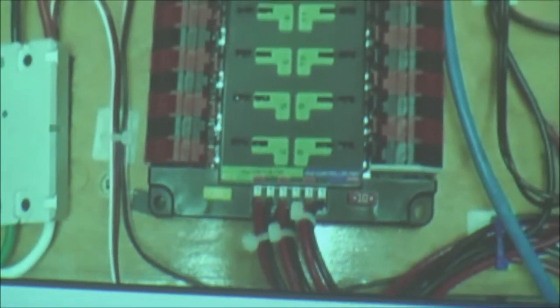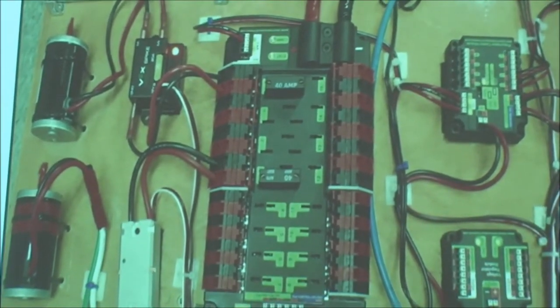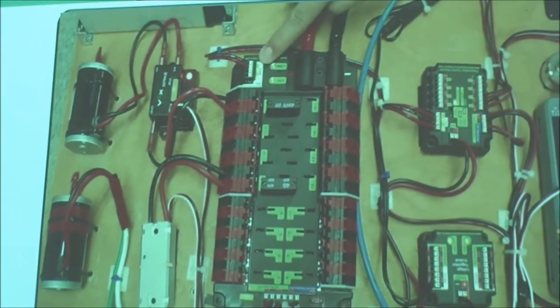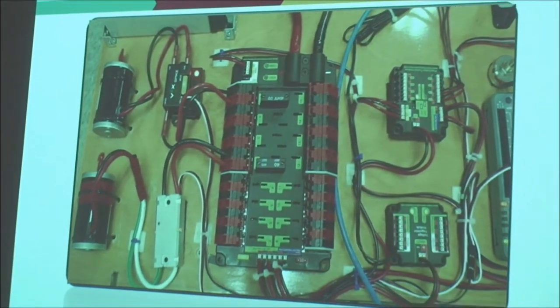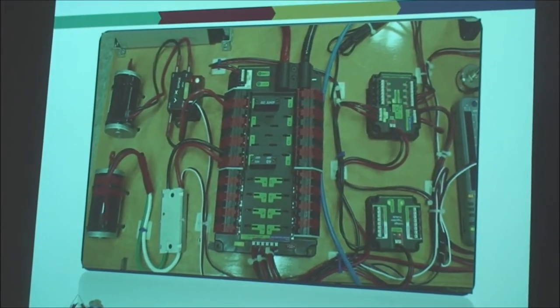There is also a detachable plastic cover over the battery terminal to prevent short circuiting. This is a CAN connection and data dump here. The PDP no longer includes the LED indicator lights that show up in the circuit.